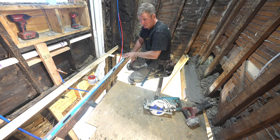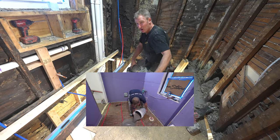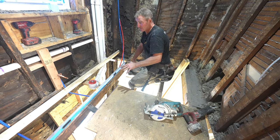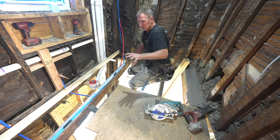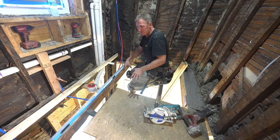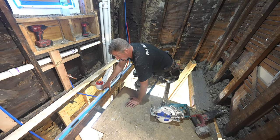In this particular bathroom I'm going to be doing some floor heating, so I'll be doing some floor leveler — I'll have an opportunity to make everything a hundred percent level if I don't get it there right now. There are a couple things with these old bathrooms where you can't always get everything to a hundred percent level with the framing, and I'll show you what I mean by that. But looking at this, it looks pretty good.